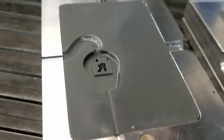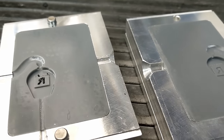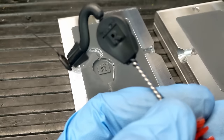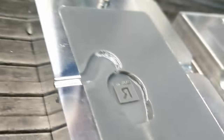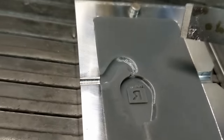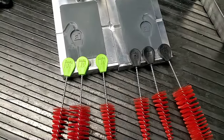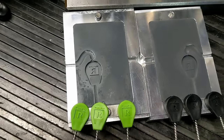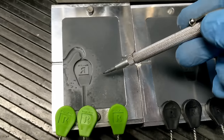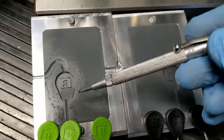It's very interesting to work with these 3D printed molds and see how they interact over time with the heat. We're at about 50 to 70 shots into this, and if you look at this part you can see big flash where the mold is just fatiguing out — shattering out. We've lost detail in the logo and it continues to deteriorate. These really are limited-run deals. At most 70 cycles in, we have pretty radical failure of the gate and side walls. The newest one, at only about 30 shots, is retaining itself pretty well; overall this has had about 70 shots.